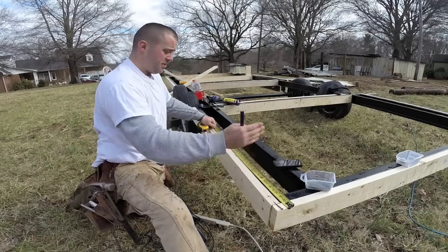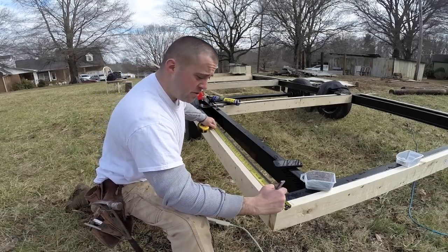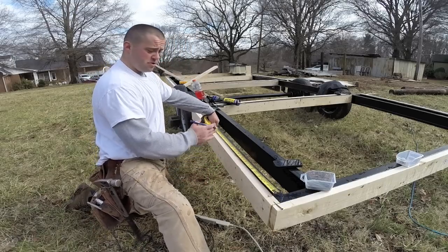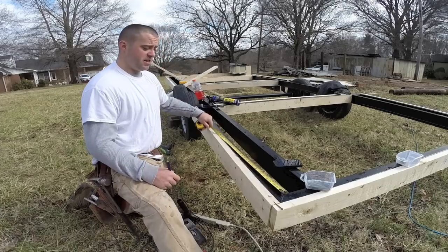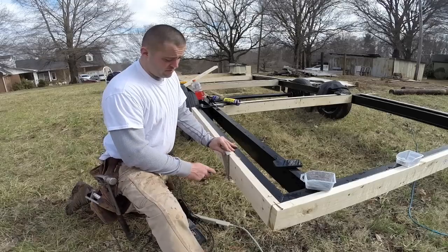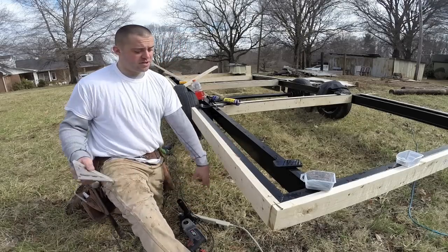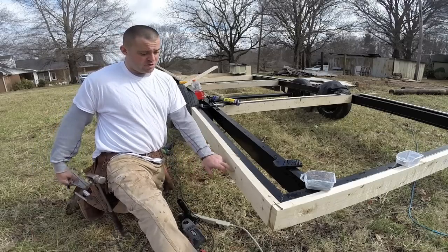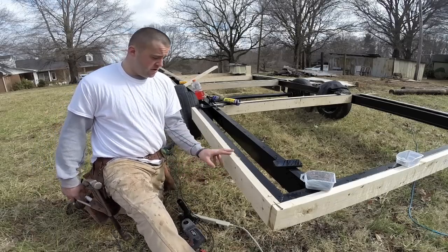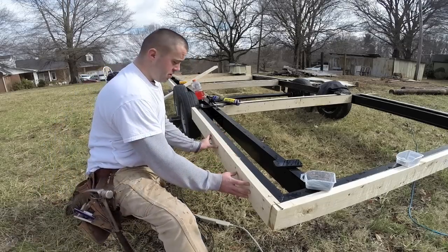My shower is going to end up sitting in this corner over here and I'm going to have a drain that comes down. If I measure in three and a half inches and then measure over — I'm going to use a 32-inch shower. If I measure 32 inches and find the center of that, I know that my plumbing is going to come right down there. So I want to go three quarters each way — it's going to be roughly right there, and that's going to end up getting cut out. I just want to make sure I've got some fastener pretty close to that, and I think these two screws are close enough so that when I remove this piece of wood it won't structurally affect these pieces.